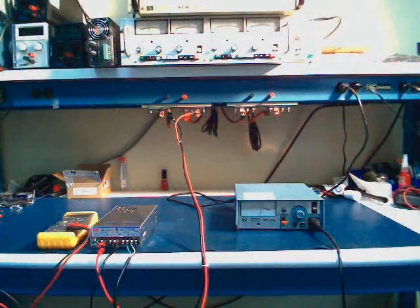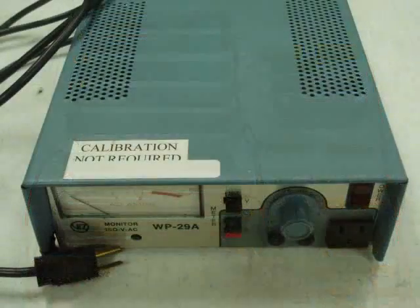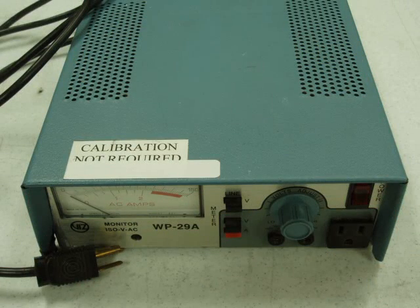To start with we will need a little bench space and a few tools, patch cords, etc. In our setup we are using an electronic load, but you can certainly use a resistor bank if that is what is available. We will use a variable AC source to enable low-line testing, but directly plugging into the mains will still yield results.